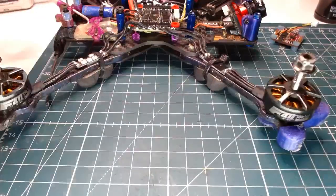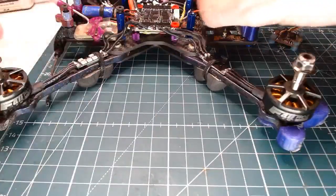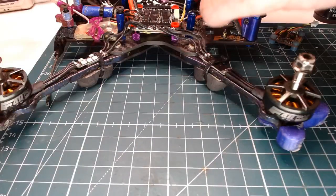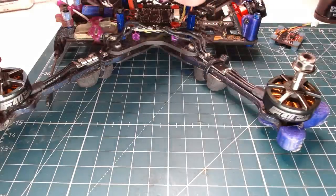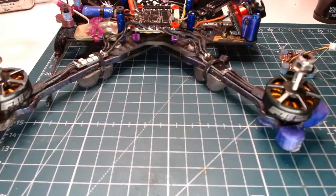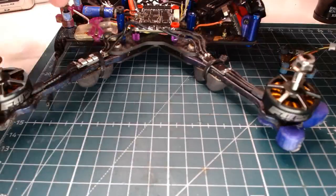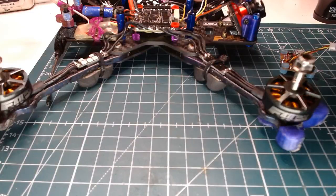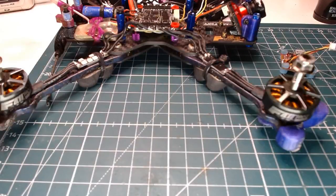Okay, so I can put this aside to give myself a little bit more room in here. Okay, so these two guys are going to the Crossfire, so they are obviously just 5-volt and ground, and it doesn't much matter where you put those. So we'll get those guys done here so that the Crossfire is finished, and then we'll just tack the VTX signal and tramp audio, rather, on there, and we'll be done.